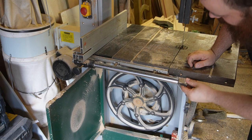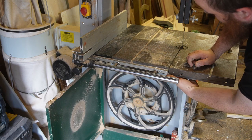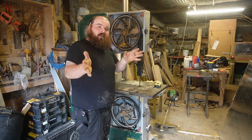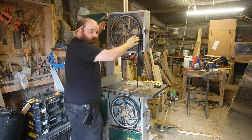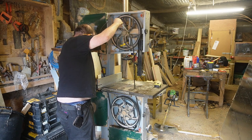Next, there's generally a gate here that lines up with the slot in the top to get the blade out. I'm going to start very carefully taking this blade out. Even though the bandsaw blade is blunt, be very careful because it will still catch you.